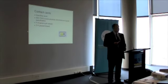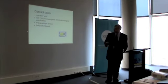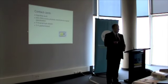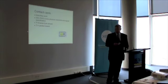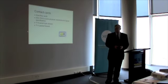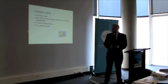As a developer, the sort of things that you need to know is that, as with all things, it's never simple. There's always improvements made from one generation to another. So we start off with the simplest cards, which worked on a simple serial protocol. Then they came up with a packet protocol. So you have to be aware of different types of smart cards. You may have to have your code doing something slightly different depending on the generation of technology you're using. So the big two that leap out as a developer are the T equals 0 and the T equals 1. But other than that, the data that you send to the cards, they're pretty much standardized between the different types.